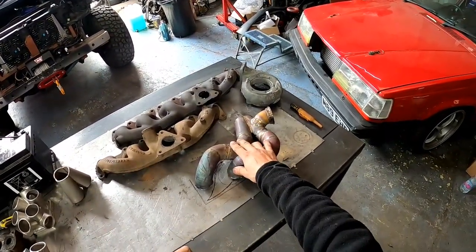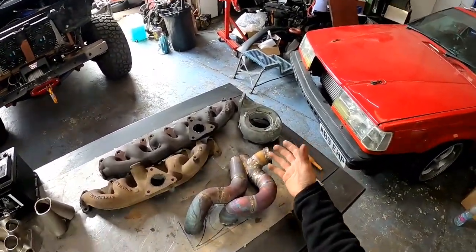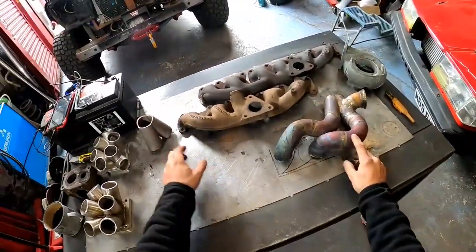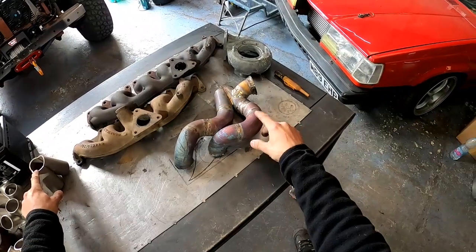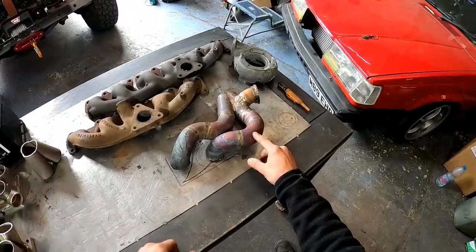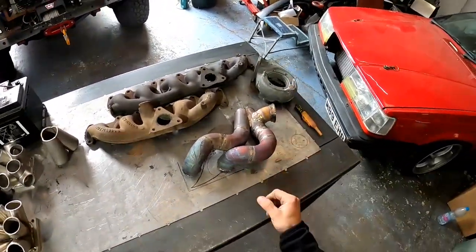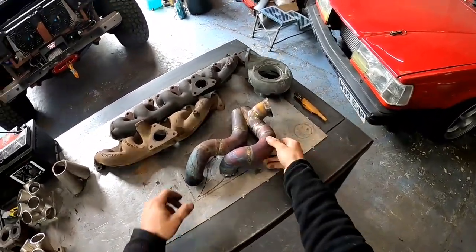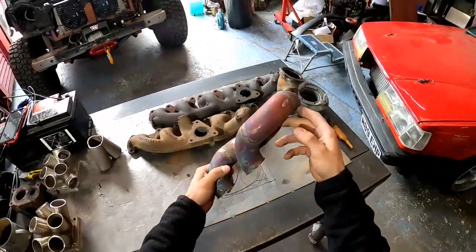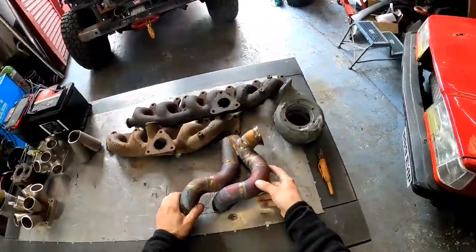On the exhaust, you want completely the opposite. You want the more volume you can have, because the more volume, the faster the turbo is going to spool. So this against this, it will have the gases hotter and more volume of them, which means only because of you using the 316 stainless instead of 304, your turbo is going to spool quicker. Simple as that. Plus, to be honest, 304 will rust. It will develop this kind of surface on the top, and this will always be like this. Will never change.